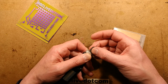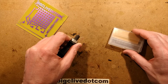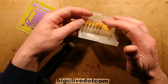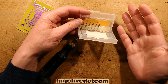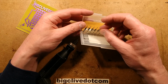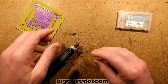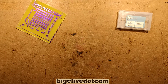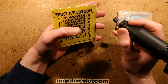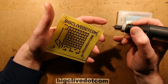The reason I call them reground is, I think these ones came from Rapid Electronics in the UK. You can also get them on eBay. These are used in the automated drilling machines, but they have to be the original length for those machines. Once they wear down, they can't use them because the machine would need recalibrated to the length of the drill. So once they've used them to a certain degree, they send them away, and there are companies that regrind the tips, and then you can reuse them. That's perfect for people like us who aren't too critical about the drill length. Also, they're so much cheaper than the brand new bits that it's just the only real option, because these are super fragile. Tungsten carbide will snap if you look at it.